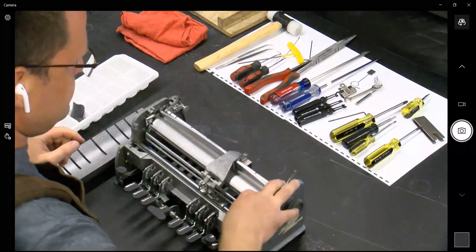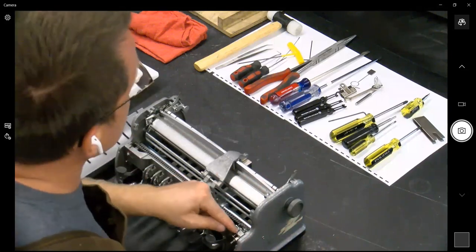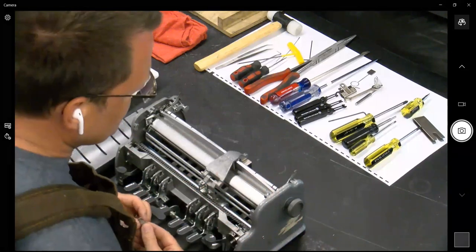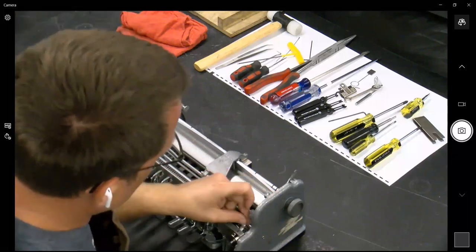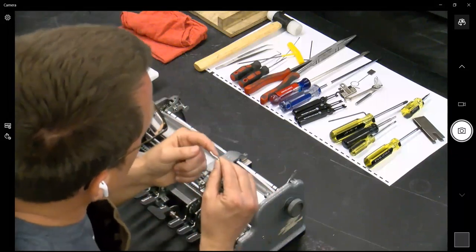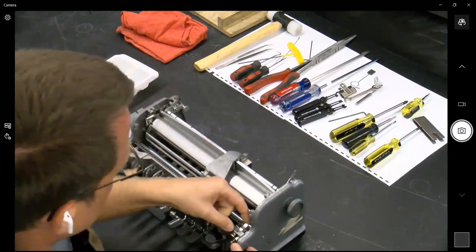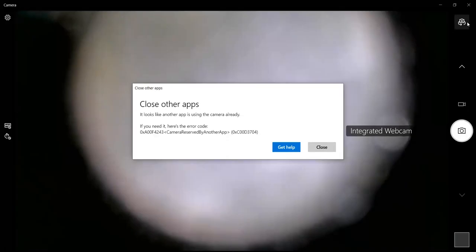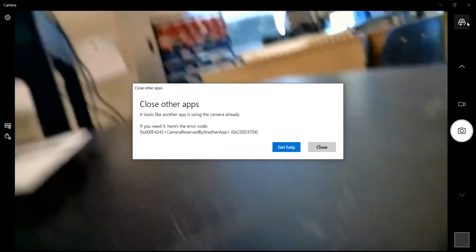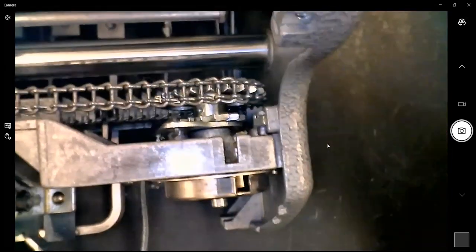Someone wrote that she doesn't have a chain check. That could be an older brailler — it would just be a nut. If it's missing completely, you can order a nut, which is very inexpensive, or order a chain check and insert that back in. When you do, make sure the curved part is facing up. If you don't have it at all, that means one of your plate screws is not fully holding the plate together, because the screw has nothing to tighten into.